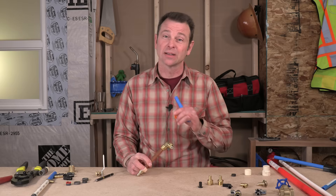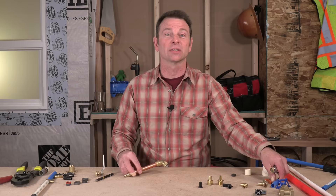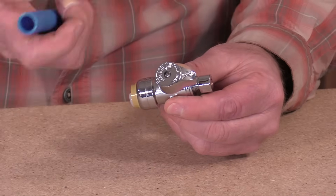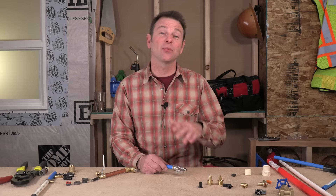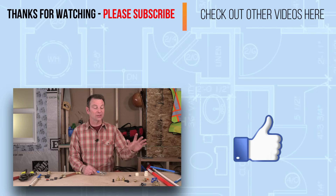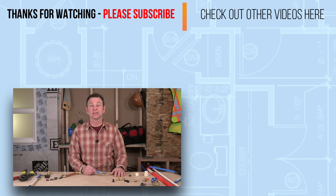These push-to-connect fittings are very modern, work with several different materials, and come in many configurations. I even have a valve here that works on PEX — a straight stop with a push-to-connect end. Instead of an angled stop, this runs in a straight line and you just push it right onto your pipe and you're done. As you can see from everything we've looked at today, that's why PEX is such a great system: we can bend it, add fittings, use valves, and put it together with hand tools — it offers a lot of options. Keep in mind we've only looked at some of the basics today; there's a lot more to come with more parts, features, and process. Thanks for watching — I'll see you in the next lesson.